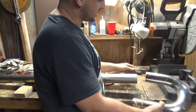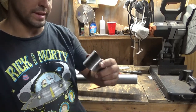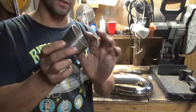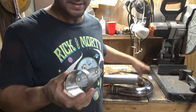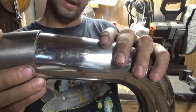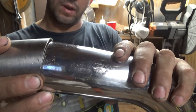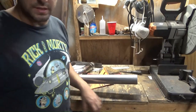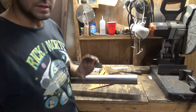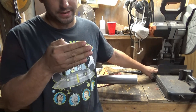It's pretty round though. Here's another thing I noticed — if you're trying to do a pie cut and you want to be lazy and do it in only three pieces, if you cut 15-degree angles it'll be three pieces. I don't recommend doing that. It's lazy, it looks too squared off, and the biggest reason it's a bad idea is the angle is too big and it won't fit good. So I'm going to do it in four pieces and cut 11.25-degree angles, but my saw doesn't have that accurate of increments, so I'll just put it on 10 and add a little bit.